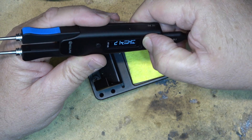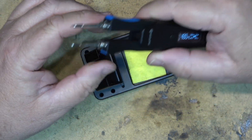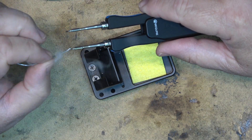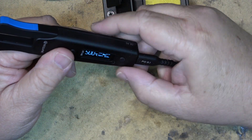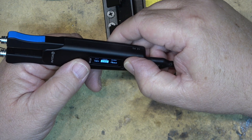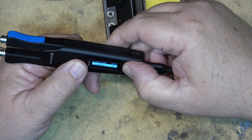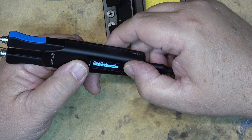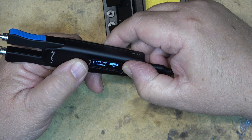To turn it on I'll just hit the power button. There — now it's on. You can see the tip getting hot right away. We'll tin these with some solder right away because soldering tips do need to be tinned. We can change the temperature here — idle temperature, work temperature is 300 Celsius. In menu number five you can switch between Celsius and Fahrenheit. I think I'll switch to Fahrenheit before I start since I think in Fahrenheit. You can dial your temperature up and down.